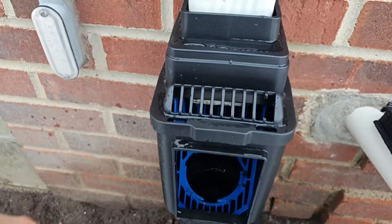This center screen that screens out the leaves is removable. The reason it's removable is we want to be able to do camera inspections, run a heated cable through here, or even push a garden hose through to chase any shingle gravel to the inline catch basin. This is a coarse screen — we want it coarse because we don't want it to plug with pollen and really small fines, which is what happens with a tight screen. We took our 35 years of experience, went to the engineers, told them what we needed for this vented clean-out leaf filter, and — not going to lie — it took a year, but it's well worth it.